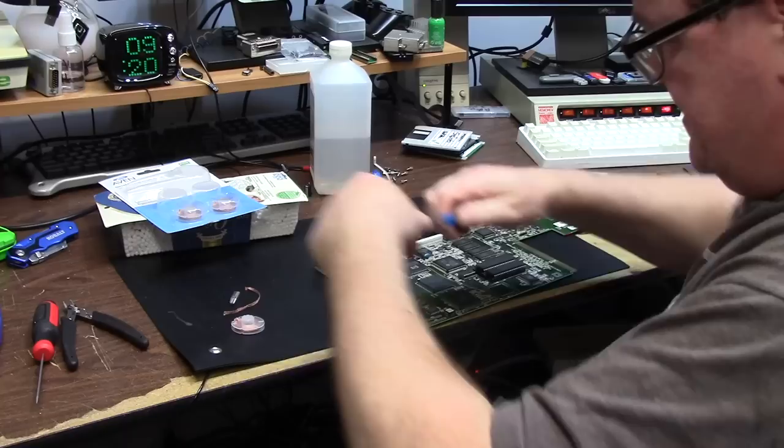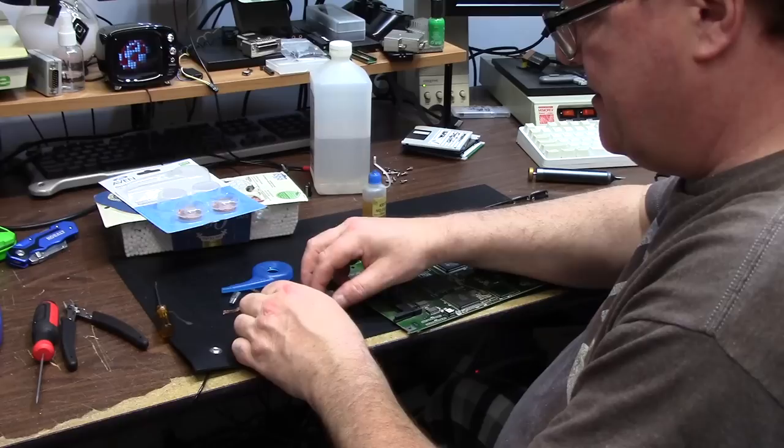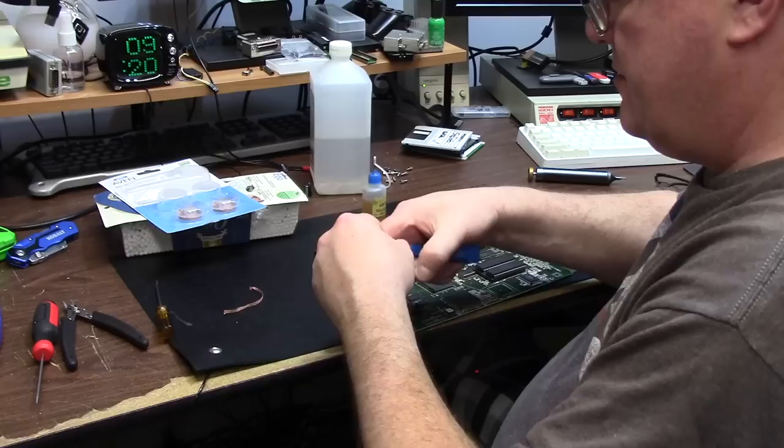Stick a screwdriver in, separate it. Peel this off. Pull out your old wick. Take the black spring, toss that, and the new one goes in its place. Put it through the little thingy, put the cover on, clip, reloaded. Cool, huh?